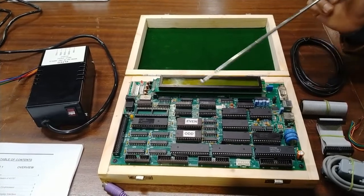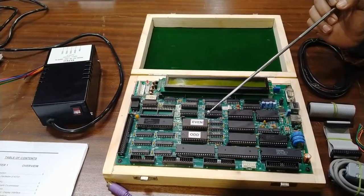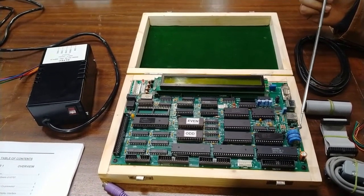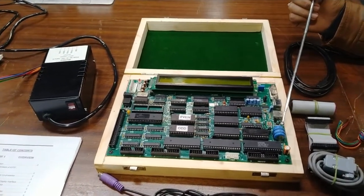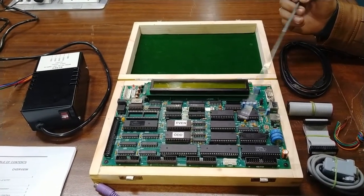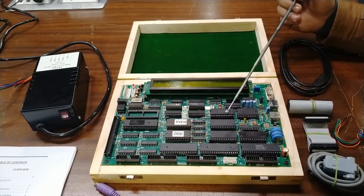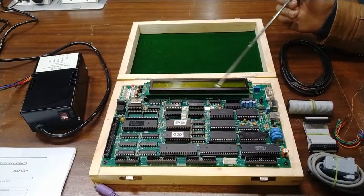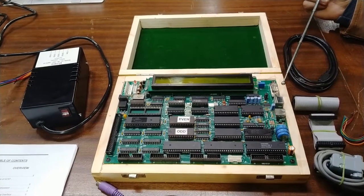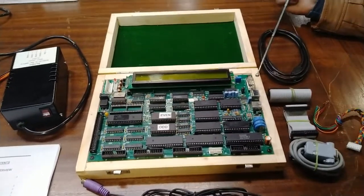The monitor firmware in a 27256 EPROM is placed in the highest 64 KB bank, and 64 KB static RAM is battery-backed at 3.5V — this battery stores all RAM addresses and values. The keyboard and display interface works with an 89C2051 keyboard/display controller for the 40x2 LCD display. The serial interface is available through RS-232 communication compatible with the 8251 USART, along with 1488 and 1489 driver chips providing necessary interface signals.